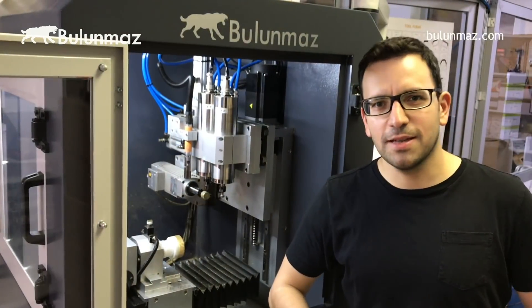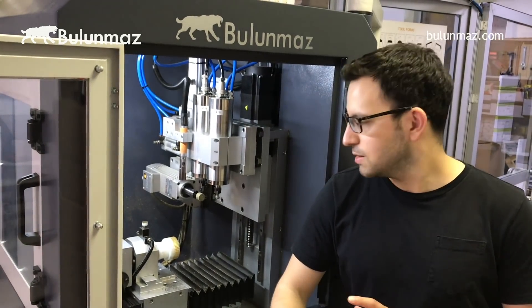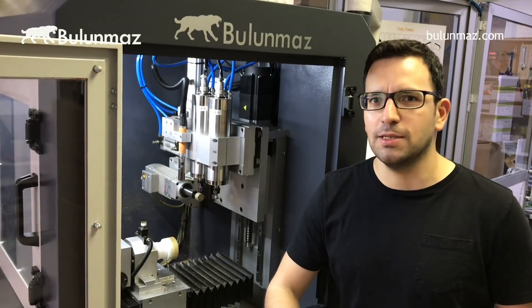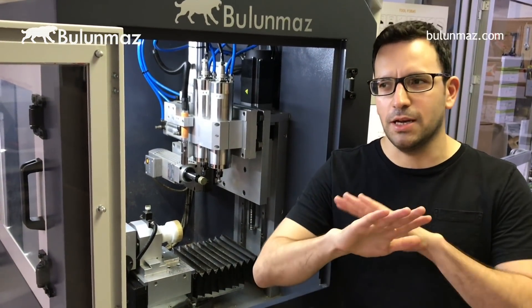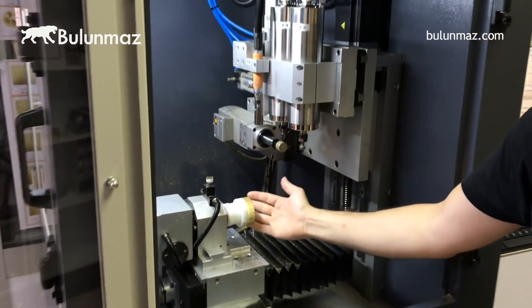That was the diamond plated background tool — we worked on a bangle with this product. The diamond plated background tool is not engraving like the other carbide tools; it just cleans the surface and gives a shiny finishing. Here you can see the result on the bangle.